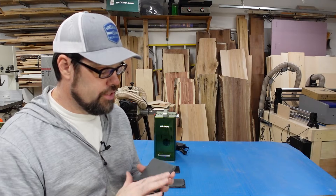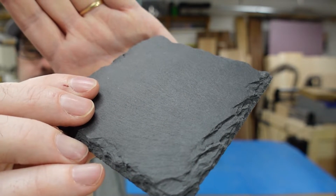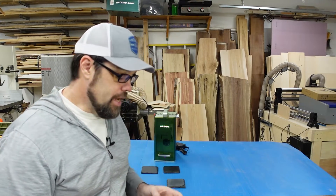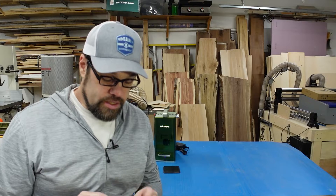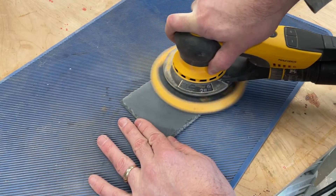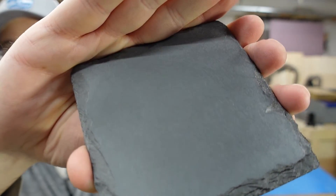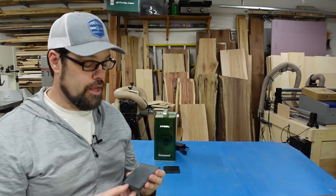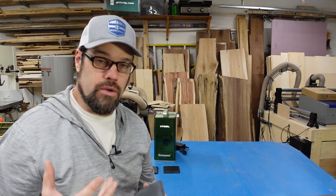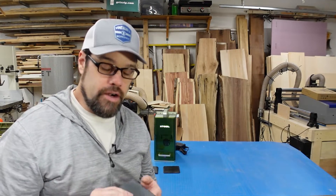It's got the natural surface — not finished — but with that natural surface, as you can see, it's just a little rough, there's some texture to it. That might be something you're looking for and it definitely keeps the stone in its most natural state. However, one thing you can do with slate tile is you can sand it. It's best done with a random orbit sander up to about 120 grit, and what you end up with is a much more smooth surface — it takes the texture away but keeps it a natural stone, which can help if you're going for a really detailed photo engrave or very crisp lines.